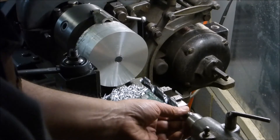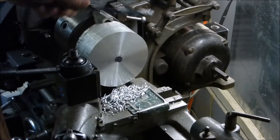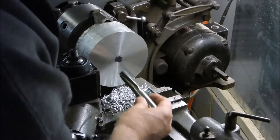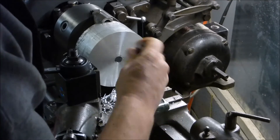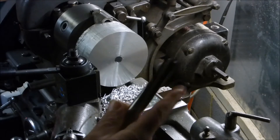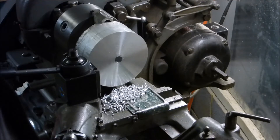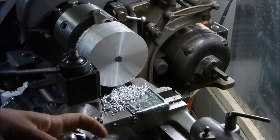At this point I'm really close to my five-eighths finish, but I honestly don't know whether you could put a reamer in - even if I had the appropriate holder or if this had the appropriate shank. I don't know if it's close enough to go in reaming. It's off by three sixty-fourths, and I think you want to be a lot closer before you put a reamer in anyway. Either way, I'm just not quite there with the tooling I own right now.